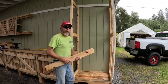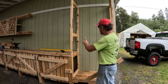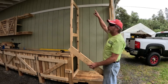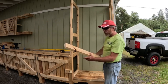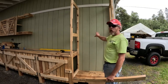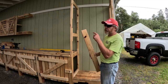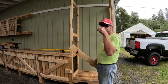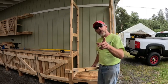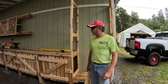On the cross pieces at the bottom I'm going to use our little jig to put pocket holes so I can get a good attachment to the bottom. The ones going to the wall we're just going to screw in from the side and then screw into the structure — basically my garage. Let's pop back over to the pocket hole jig and show you how that center hole is used when you're working along a longer run. There's a center hole B — I'm going to eyeball the center, put it in place, clip it down, and instead of using the end holes or doing two, I'm just going to do the one. Thanks again to the subscriber for sending that in.